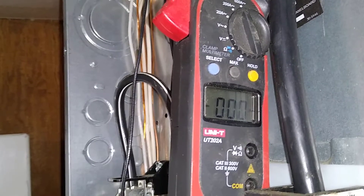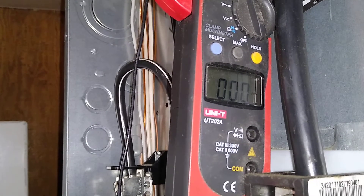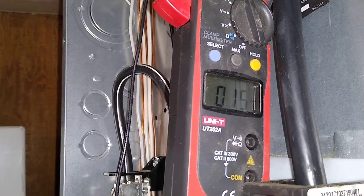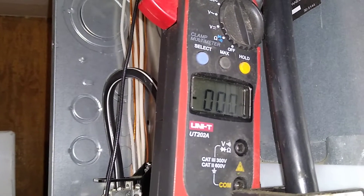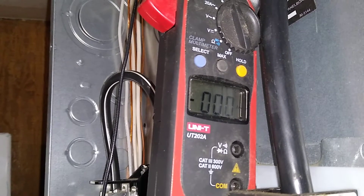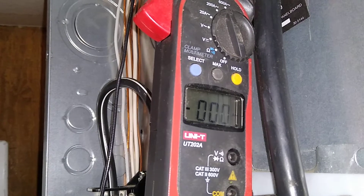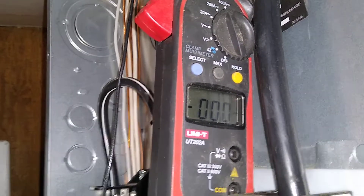This is not a peak meter, but let's see what it does. I've done this a couple times, waiting in between each startup. I see about 75 amps each time, and about 15 amps running on the 5 horsepower 60 gallon. Now I'm going to flick this 100 amp breaker.